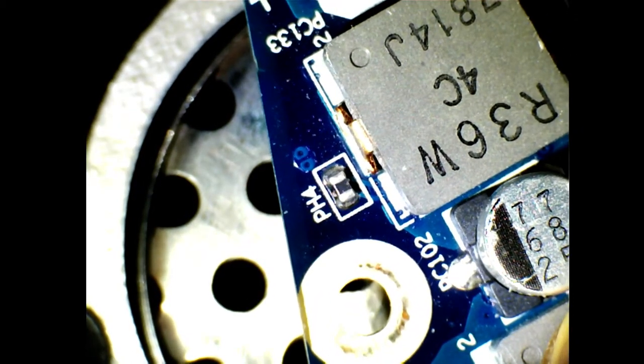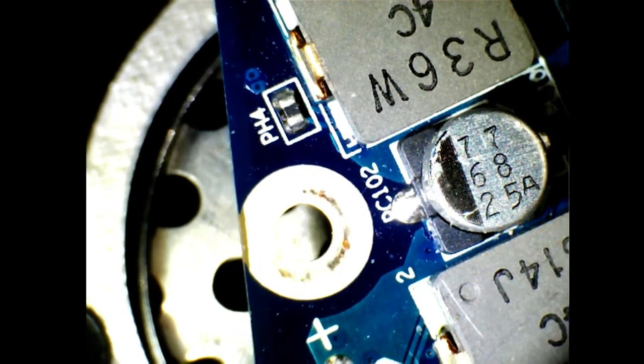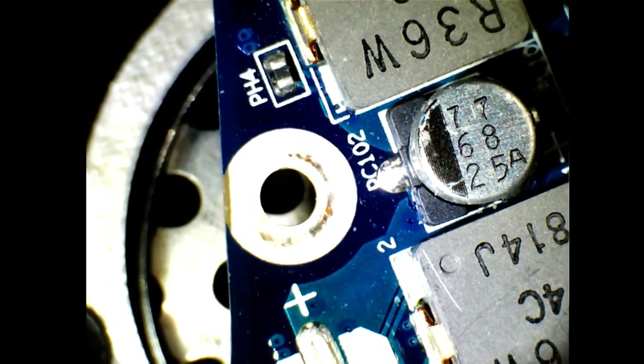So yes, again and again, a preheater helps. If you can buy one, it doesn't have to be expensive, any cheap preheater, but try and avoid buying large preheaters, because effectively what you're doing is exposing hot air to the entire PCB or the bottom of the PCB. So, thing to remember is when you're exposing heat, try and avoid areas with these capacitors on, because you can quite easily damage these capacitors by exposing too much heat.